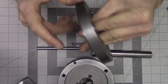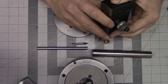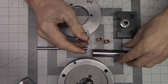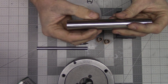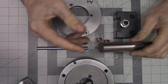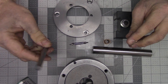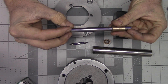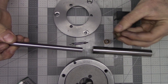My plan is to hold this outer plate in the chuck, index the spindle, and come in from the side with the tool post drill. My idea for this very simple tool post drill is to use my boring bar holder, which has a three-quarter inch bore. I'll need to create a sleeve — I'm going to use this piece of 304 stainless, turn the diameter down to three-quarters of an inch to fit inside the boring bar holder, and drill and ream it to accept a couple of bronze bushings. The spindle of the drill will be a piece of drill rod that fits in the bushings, and I'll be able to chuck the drill rod in my cordless drill.